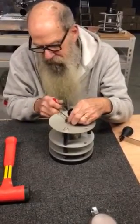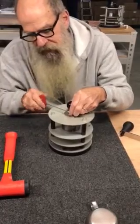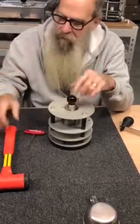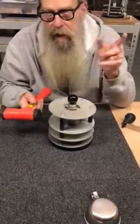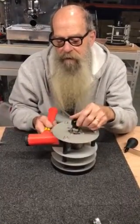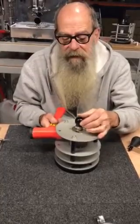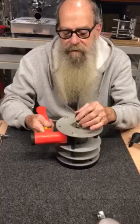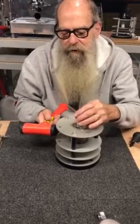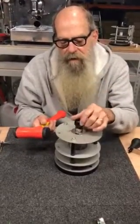I'll come back in here again, and you can do this like forever. I go a little closer. You notice how I'm picking it up and sitting it down so I don't change anything. Now I've got a loose spot there and a tight spot over here. What you do is begin to ask the question: can I make it better? Now I'm going to physically move that ring burr — you do this by small taps. This might be a big hammer, but I'm not hitting it too hard. I'm steadying it here to make sure what's moving is the burr. That made it nice. As you go closer and closer, you're able to turn this with no touch of the burr. Sooner or later you reach the point where it just touches all the way around and you can't sense this operation.